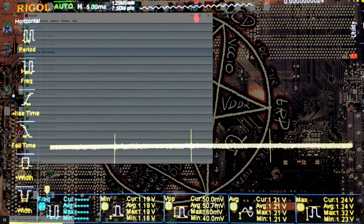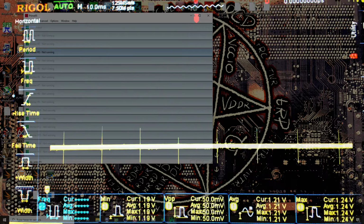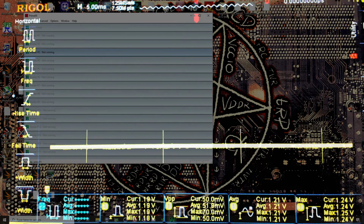Anyway, that doesn't mean we can't observe the effects of fiddling with settings in the BIOS. So that's what we're basically doing in this video. Anyway, let's run some Prime95 and move the mouse around, because that's the worst case scenario transient you can apply to basically any motherboard. Prime95 pulls a ridiculous amount of current, especially with the 12900K that I have here. And by moving the mouse around, you interrupt Prime95's workload, and that causes horrible overshoot and then undershoot once Prime95 resumes. So, yeah, here we go.